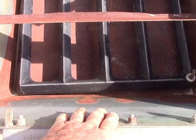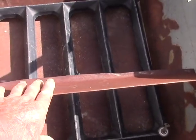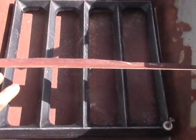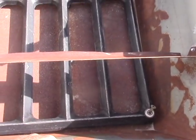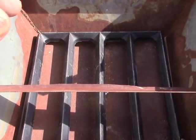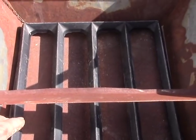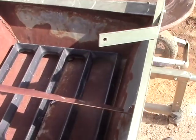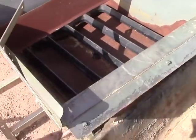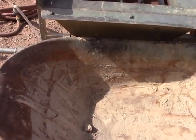You throw in the original material here. This modification is specifically designed for microfine gold — it forces all the material on this side to go under the water before it can exit. That way you know the gold has been wetted. I've been told that makes a big difference when you're dealing with hard rock. Then it just overflows this side and I'm catching the tailings there.